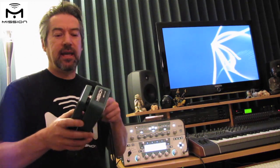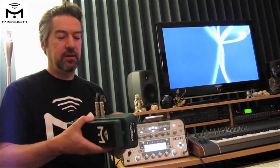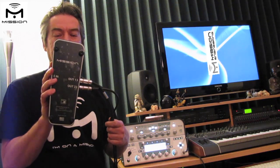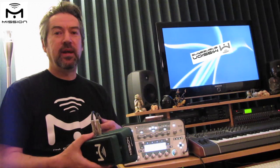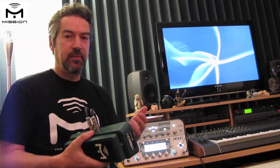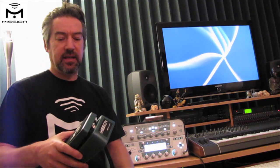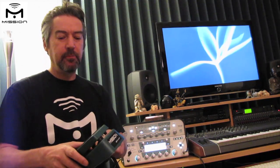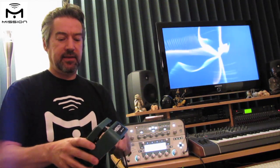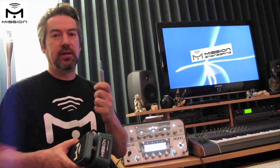This is the EP1KP expression pedal — it's in a nice matching green colour. We have two outputs on the pedal marked OUT1 and OUT2 on the base plate underneath. Output 1 on the expression pedal is the pedal itself, and we use a TRS stereo cable to make that connection.